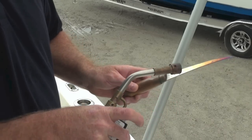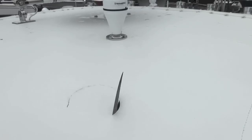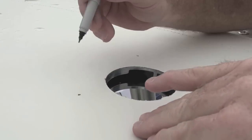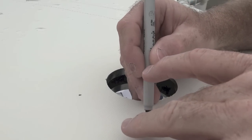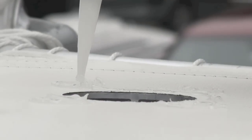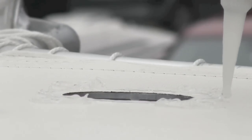One of the easiest ways to prepare the canvas for the installation of the outrigger bases is to get an old fillet knife and an old screwdriver out of your garage, heat them up with a torch to where they're almost red hot — that way it cauterizes and sears the canvas and keeps it from unraveling. Find each pre-drilled hole, mark it with a magic marker to make it easy to find with the bolts. Go around the main opening and each pre-drilled hole with some clear marine grade silicone before you set the base.